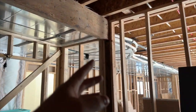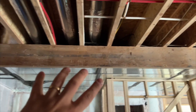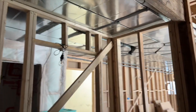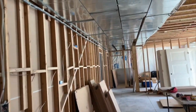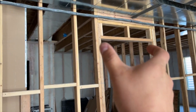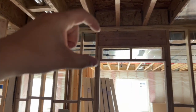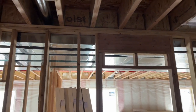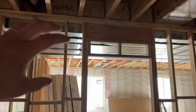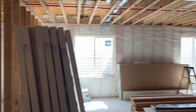We have those supports on each side. That is how a beam functions the same way a load-bearing wall would — carrying the load from each joist out to either side. If you wanted to take out a section of a load-bearing wall, you'd do the same thing. This door already shows that idea with a short beam. You could lengthen and size up that beam, maybe use LVL instead of dimensional lumber. The specifics depend on each home and the engineering required.